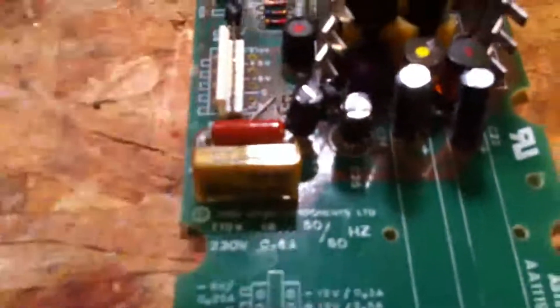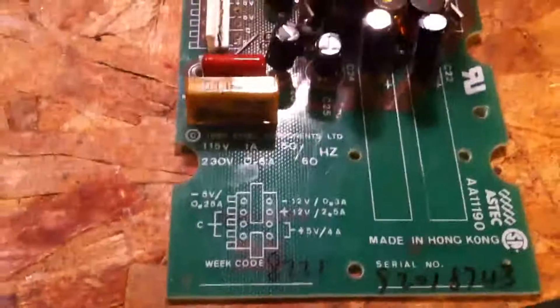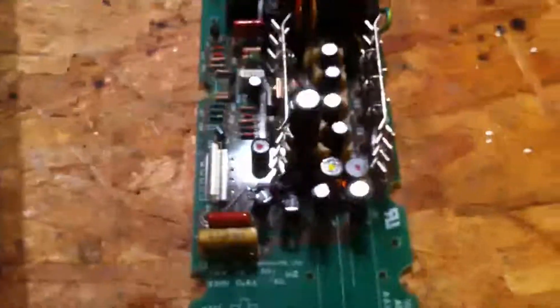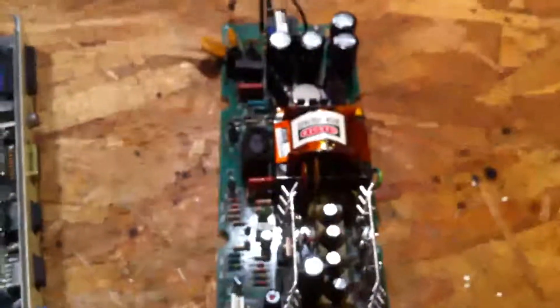Update on the power supply — it's currently down because I had a safety cap, which was right there. The other day it was working just fine, and then the safety cap, which kind of looks like this here, decided to explode and start smoking. So both those safety caps are getting replaced.